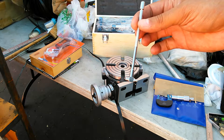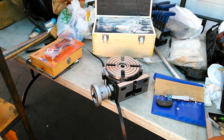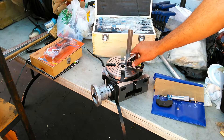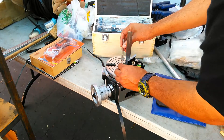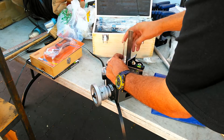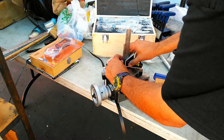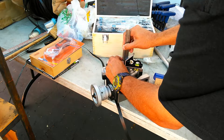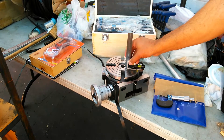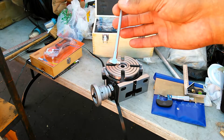The trick is you want to get this into the bore straight, because there's going to be some yaw. To absolutely guarantee that you have it straight in the bore, you could use a square on it — you've got to get it square this way and square that way. So now I'm going to insert this into the bore and make sure I get a square measurement out of it, a little bit deeper into the bore. We're locked down, and the reason I know that was square is because the bottom of this is square. So I've locked this down to the size that it actually is — it's going to give me a nice accurate measurement.